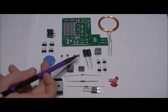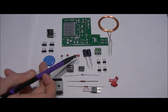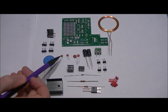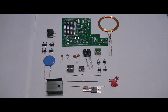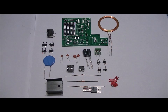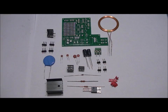The 0.1uF capacitors are of lesser consequence — you still want them, but less critical. You have to make sure that you place the 10N and the 200 picofarad in the correct spots, or else your circuit is not going to work right and you could burn out your FET. We'll get to the remaining capacitor at the end of the transmitter portion. Solder everything into place, and next we will do our pin headers and electrolytic capacitors.